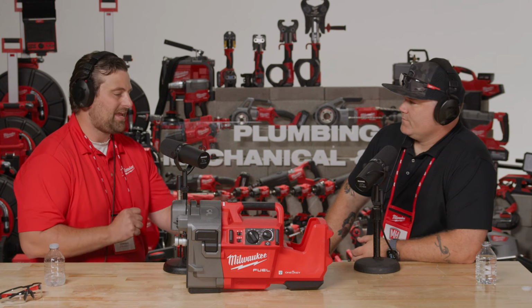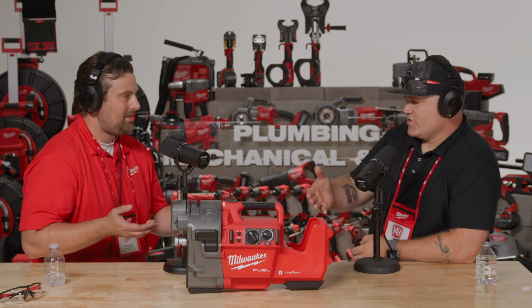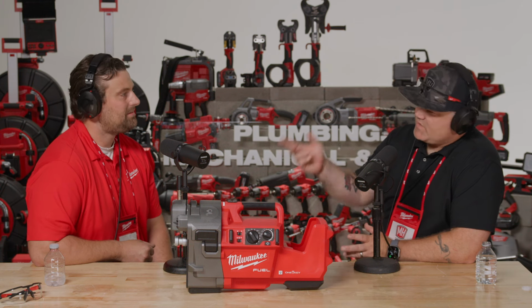Totally. Yeah, the hallway is narrower. They can't hurricane the pipe, or they're trying to put it up in the ceiling. Working with Schedule 40, it's heavy, so having to negotiate the pipe around in that space just didn't make a lot of sense. With this machine, instead of having the stationary power head, you could take this off one end of your 20-foot long pipe, walk to the other side, and just roll groove it there, because this machine is spinning around the pipe versus the pipe spinning around the machine.